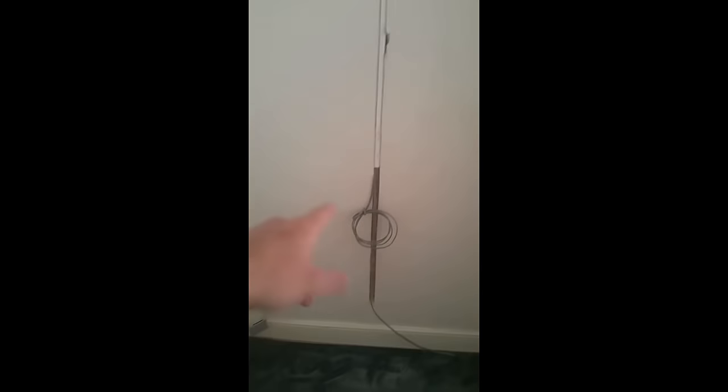We've got a cable in for the light, a chase in for that socket, and a chase in for that socket. Fairly confident we can get to that light — we just need to shift the furniture, drill underneath the floorboards, and there's a void up there. It's like a little false ceiling type thing, so that shouldn't be too much of an issue.